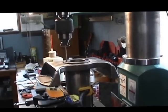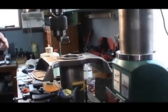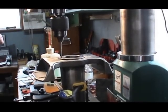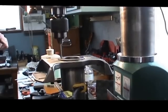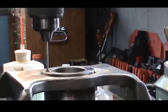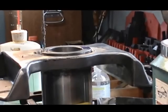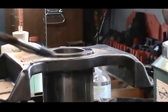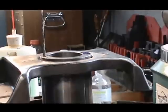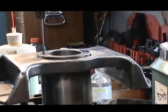And there's the bottom of the hole right there. I'm going to set my 0. I've gone down pretty close to 5/16 there now. Now I'm going to return, pick that out, clean the chips out, lube it again. And I'm going to go back down about a 1/2 inch at a time, and then switch to the larger drill